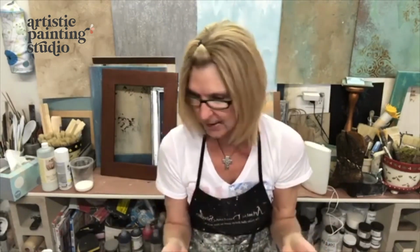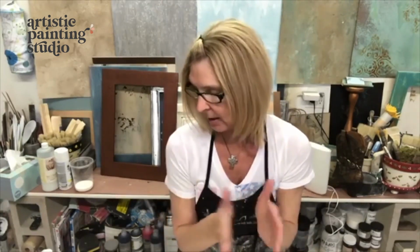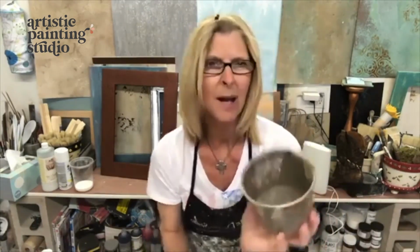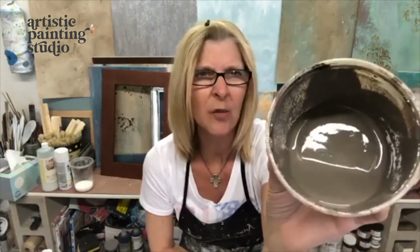And I'm going to tell you one of my great secrets, okay, is when I'm trying to get some of these weathered wood colors, okay, I start with some of my darker umbers and kind of create the tone I'm looking for, okay, or obviously the color. And I got that between the Dyke Brown and the Coffee Bean. And then, like I said, I wanted to create more of a weathered wood and kind of a lighter look, so I added white to it to lighten it up. This is my color, okay? I'm hoping, I think it's going to be dark enough to get the contrast I want. And like I said, I've already mixed it up. So a quarter cup of glaze, and then just add your colorant slowly.